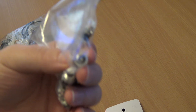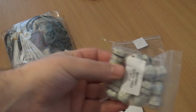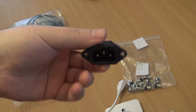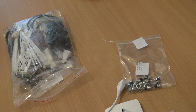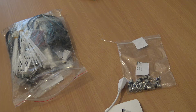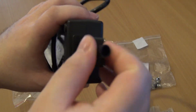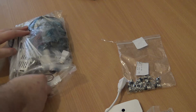I've got some various DC female connectors, some screws, various USB connectors, some cable glands, and a main power connector. I want one input that will power everything — the lights, the Raspberry Pi, the amplifier — all in one cable. It takes a normal power plug and converts it down to use the power supply that comes with the AquaRays. So the AquaRay power supply will sit inside the project box, wired to that connector.